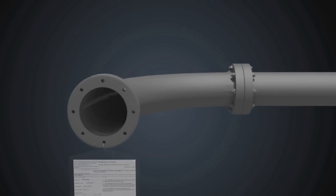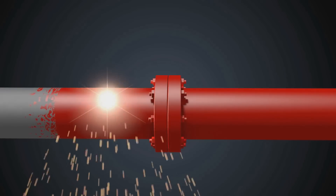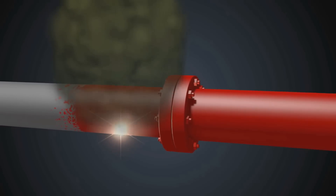An additional measure for preparing a safe work area for hot work is to inspect the actual piece you will be working on for any unknown coating. Never apply heat to a work piece covered by an unknown substance or coating. This could produce flammable or toxic vapors.